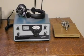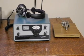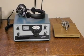The HW8 is a QRP transceiver covering the 80, 40, 20, and 15 meter amateur radio bands with coverage of the first 250 kHz on each band. It was manufactured from 1976 to 1983. It sold initially for about $140 US dollars. My 1982 Canadian Heathkit catalog lists it at $289.95 Canadian, equivalent to $600 to $700 today. It's in the two-tone green style like other Heathkit gear. It's a direct conversion receiver that can receive CW Morse code and single sideband signals, but not AM. It's all solid state, utilizing 14 transistors and two integrated circuits.